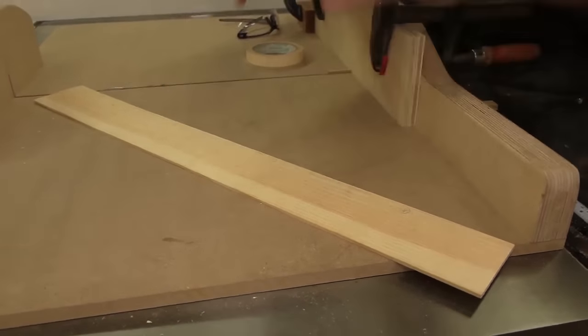Now, if you don't have a wide board with quarter sawn material, you can take a piece like this. Here we've got a plain sawn piece, but you can see it's plain sawn, so it's arcing like that. If you can flatten one side and then join an edge, then you can go to your bandsaw and make some cuts like this. You're making cuts and you're going to start getting into rift. That's where it starts getting angled, but that's still pretty stable material. I like to make an arrow so that I can reassemble them and then glue them up right side by side.